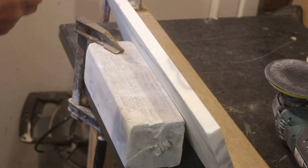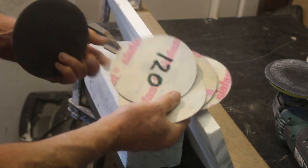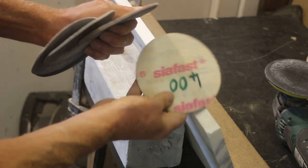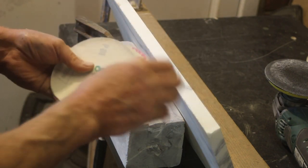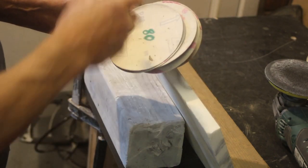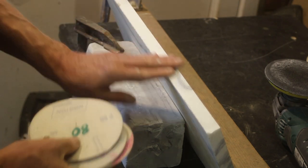We're going to be using silicon carbide paper discs, and we're going to be using a set of five: starting with 80 grit, then 120, 220, 320, and 400. The type of discs you buy may have slightly different grades, and different manufacturers tend to use different grades, but as long as you're somewhere in the ballpark those five grades should give you quite a nice polish on a bit of marble like this.